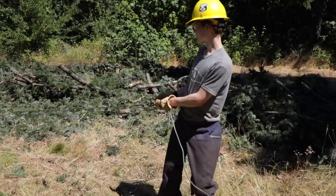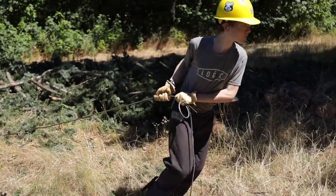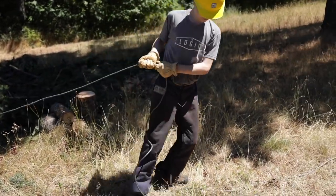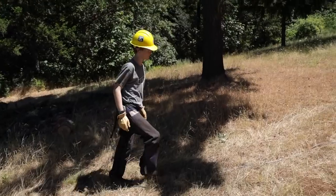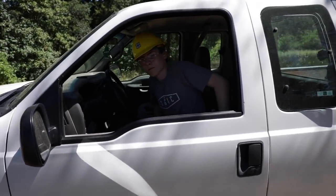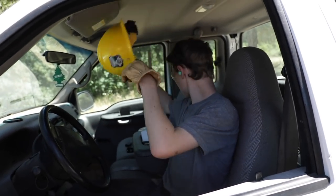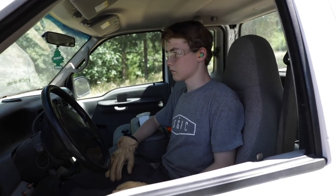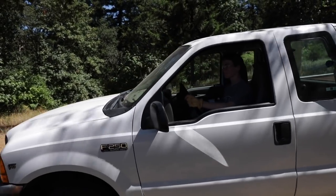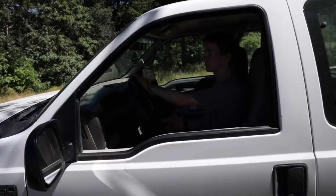Lay it on the ground, then go ahead and jump in — I'm going to have you run and drive the truck. Slide your hands, let's go ahead up, keep going up about 20 feet before you lay the cable down. Now you can lay it down and it won't come unhooked. Jump in the truck. Low range four-wheel drive. Once you've committed, once you start going, you don't want to stop — because if you stop, you'll lose your momentum and you might not be able to pull the log. Do a nice, even, steady speed, look over your shoulder, and stop before you hit the tree. Go slow until the cable comes tight, very very slow. Remember what happened to James May on Top Gear when that cable came tight? You don't want that to happen to Eric.